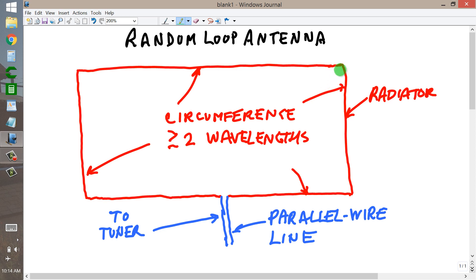Get this thing up as high as you can above the ground. Again, this is a top view of the antenna, and then you just take it from there. As for the radiation pattern, I'm not even going to try to figure out what that might be. It's just an idea, just something to try. If you have a lot of good wire, a lot of real estate, a good transmatch designed preferably to tune parallel wire line...